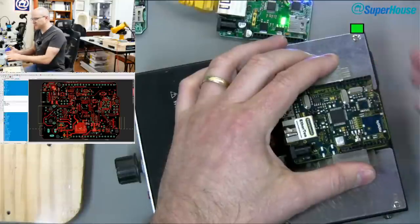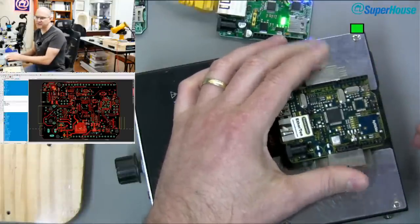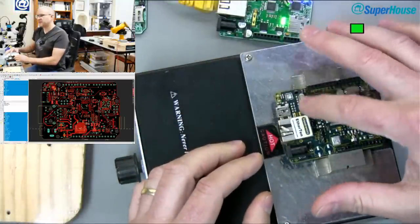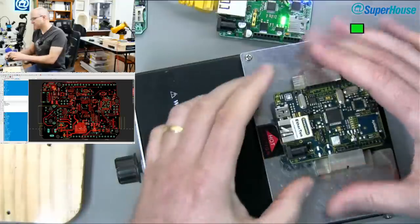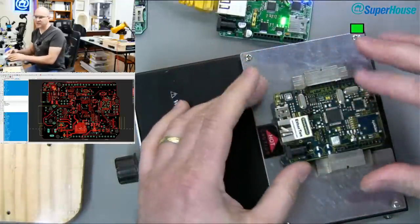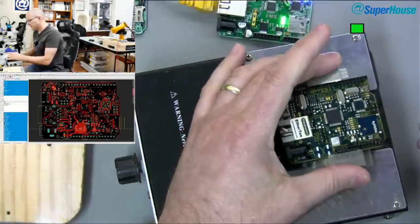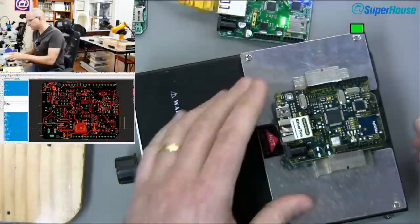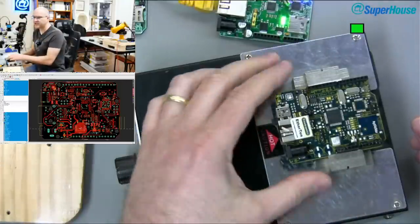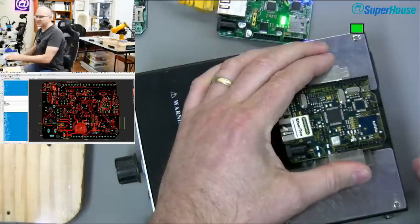If you bring the entire board up to something that's below melting, like say you bring it up to 120 or 140 degrees, then when you heat up specific parts of it to remove or rework those areas, there is less thermal differential across the board. So you get less mechanical stress because of expansion and contraction, and less thermal shock because the temperature is not changing as rapidly as you heat those parts up.